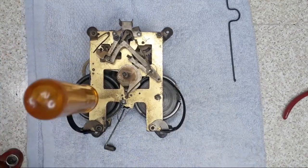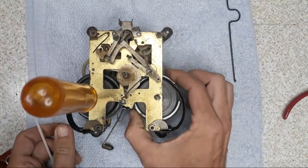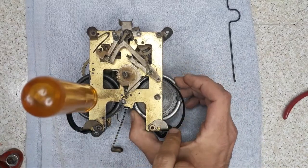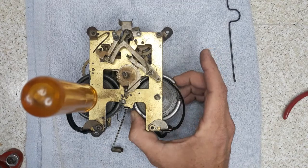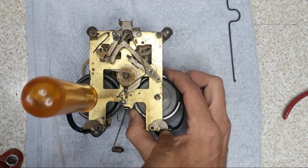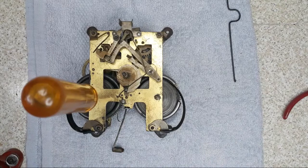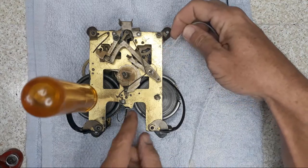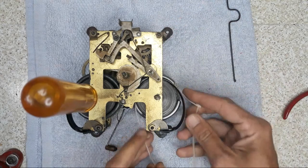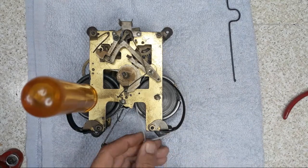And I'm going to let everybody in on a little secret, what I do to keep these little tails from going all over the place. We're going to hold the bulk of the mainspring here in the clamp. What do we do with that? It's like a little thumb buster. You pull that off, and it's just going to either send this wheel shooting up that way, or send this shooting down that way. Either way, it's not really going to want to move, so we have to release tension. Here, what we do is take a zip tie, clip the end off this. Stick this through. You can feed it around the mainspring. And really, the only thing the zip tie is going to hold is this little tail right here.